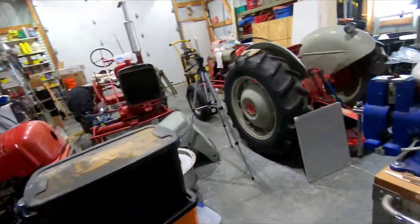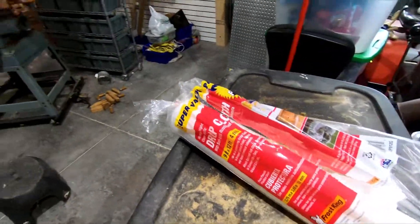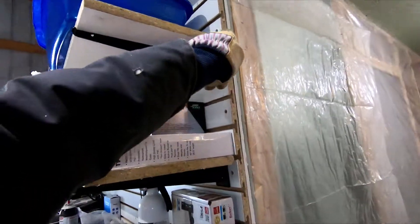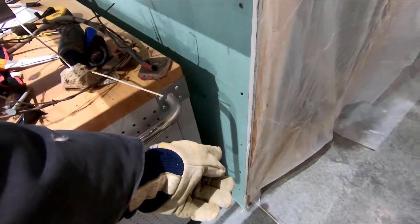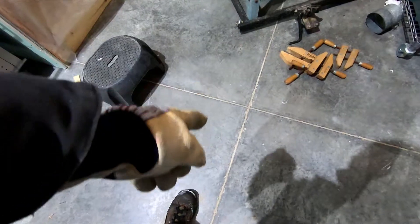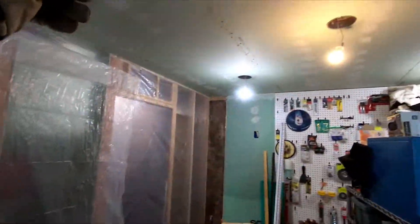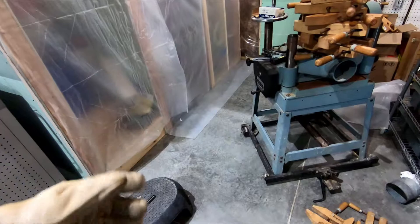I got one more roll of plastic — I got a lot of plastic, but one more roll to go. So what I got to do is start here and then staple it along the edge, kind of bend it and staple it, and then to the drywall, let it flap onto the floor like that. Then I got to come to wherever I'm going to put the opening, which will probably be right about here, and then just cut it straight down. Then start from that end and work my way over, so when I get to here it should overlap by probably a foot.